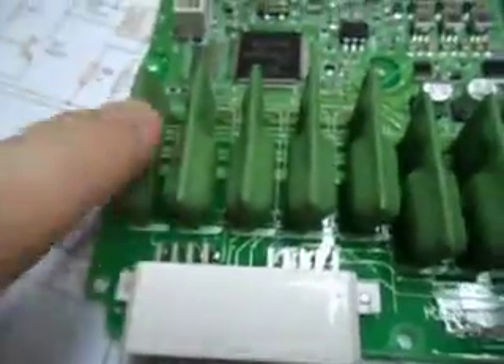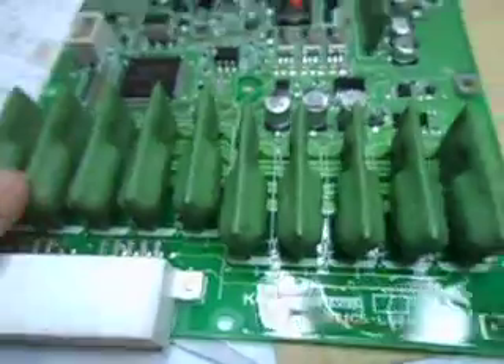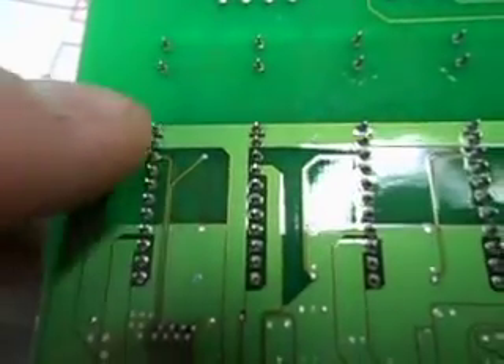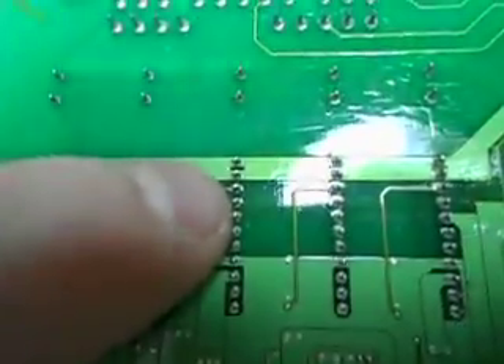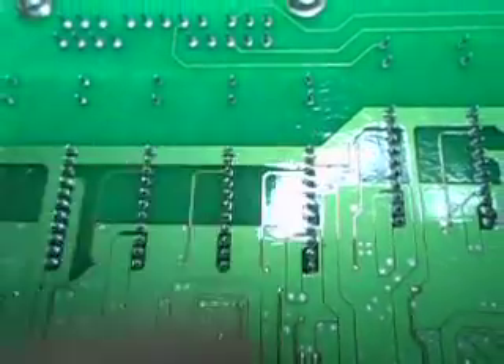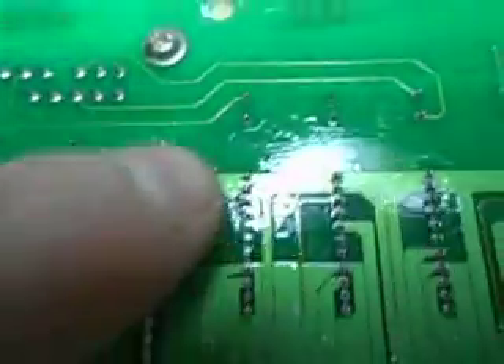These are the individual isolated voltage channel sensor boards, potted. The critical thing with these is the output, and the output from these is the third pin down here, where you can see the very small track connected to it. That's the output, and that goes via the circuit board to the inputs to the resistor and capacitor filtering for the ADC.